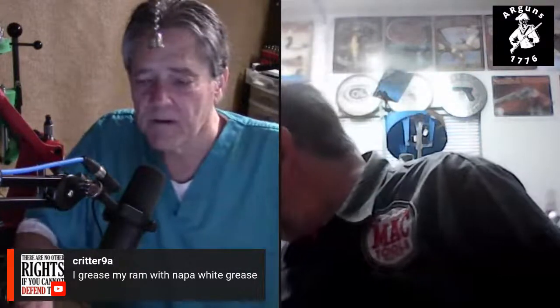Napa white grease. I never thought of that. But I guarantee you Vaseline, though, or red and tacky, it fills the voids on a press on the ram. Boy, like you wouldn't believe. And it don't take much. I'd usually put just a little on my fingertip and run it around the ram. I have a thousandth of an inch play on my T7. I mean, you have to really move it to know it. And once I put that Vaseline on it, boom.